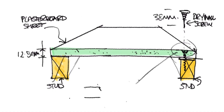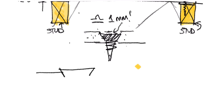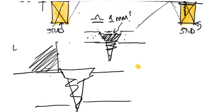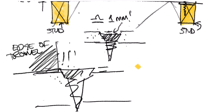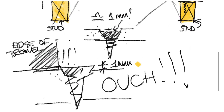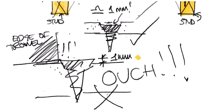When you're fixing the screws, make sure they're just a tiny little bit below the surface. If you do them flush or above the surface, you'll find that when you are applying your plaster, the metal of your tool will tend to scrape over the top of the screw — which is bad for the scraping noise and for your actual trowel because it will get scratched. But we'll talk about plastering trowels in a later video.